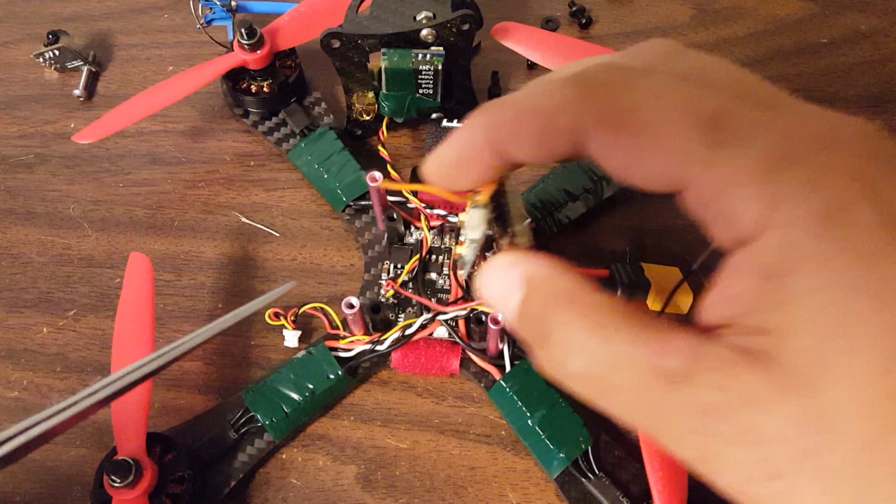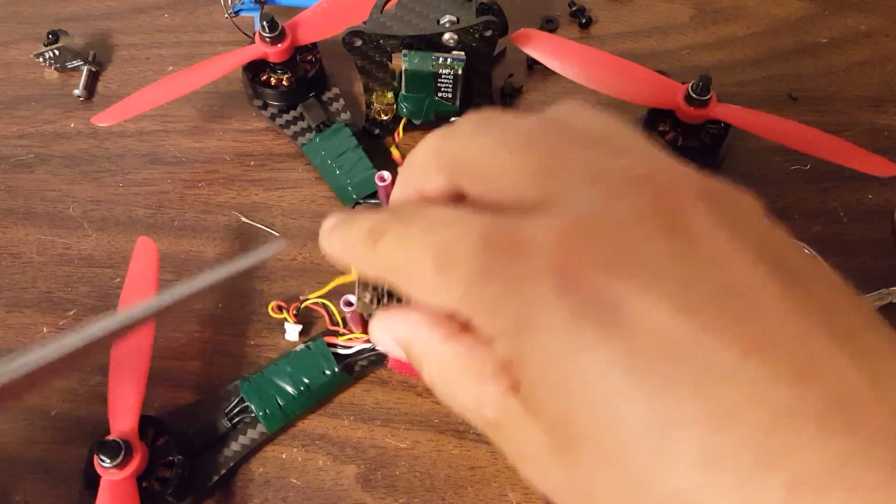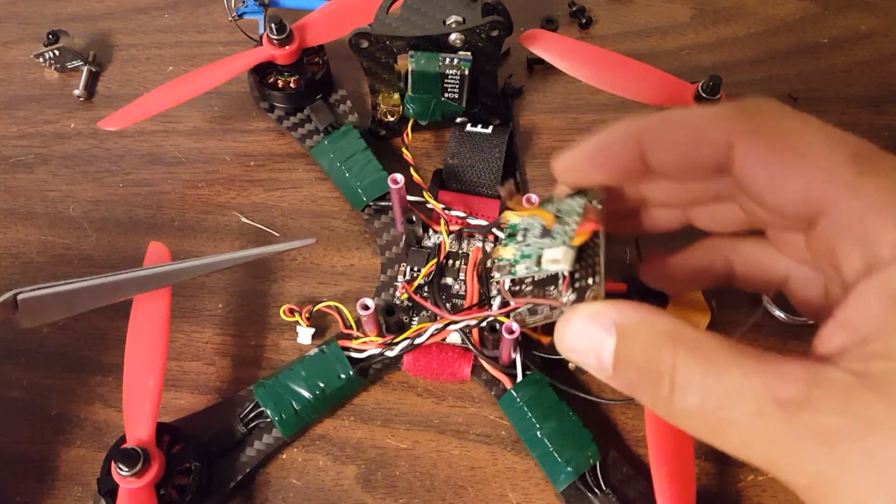Joshua from the future here, just a real quick note. Of course, you don't have to run the wires over to the top of the board if you don't want to. You can solder the wires to the bottom of the board if that's what makes sense. But if you do that, leave yourself enough slack in the wire, fold it underneath the board so that you can still hinge open the board if you need to work on it. Don't just use as short a wire as possible, so that basically you don't lock yourself down so you can't fold this open.